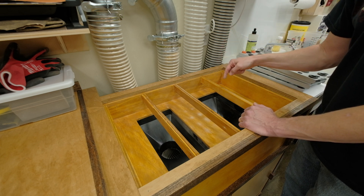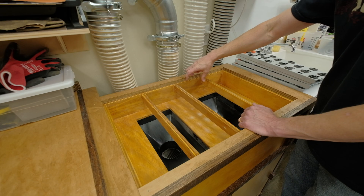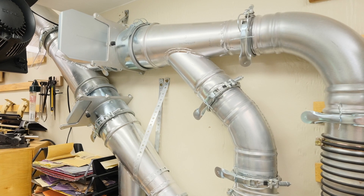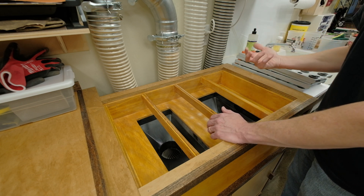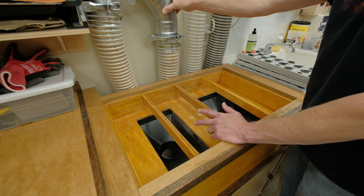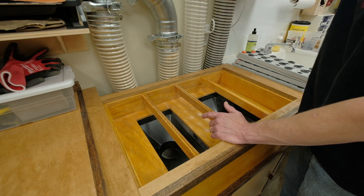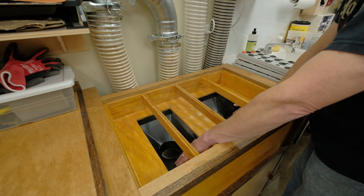That was actually another consideration of why I decided to go with the table as opposed to a box. With a box sitting on my workbench, I would likely have a single four-inch dust port on the side. With this setup, because I already had a six-inch pipe coming to this area for the miter saw, I was able to add a double four-inch connection. It comes off a Y, taking a six-inch into two four-inch flex hoses that connect to these two large dust ports, giving me really a lot of airflow with no dust escaping. This type of clamp-together piping is expensive, but it saved me a lot of headache — I was able to just buy a few more parts, reconfigure the piping, and add two blast gates so I can switch between dust collection for the miter saw and for the two ports on the downdraft table.